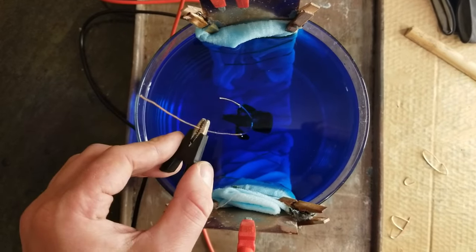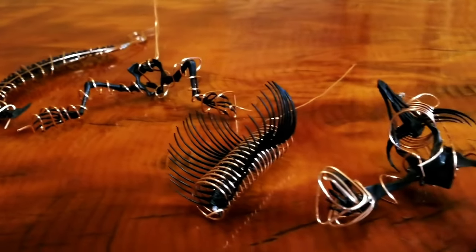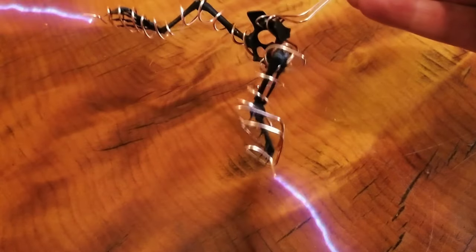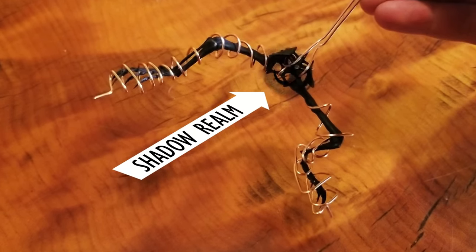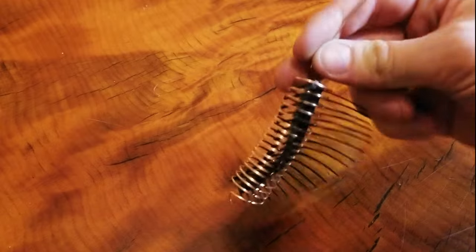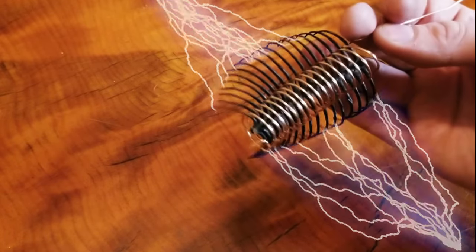The other solution is to change up the orientation of the print, by regularly repositioning it by hand or by using a constantly rotating mechanical jig. With these principles in mind, I prepared my 3D prints for plating strategically. For example, these legs are each loosely wrapped in copper wire, with a lightning rod sticking out past the pointy toes on each side. I also knew the inside of the pelvis was going to have anode shadow problems, so I intentionally ran the wire close to the inner surface to bring more current there. I took a different approach with the vertebrae, wrapping only the vertebral bodies with wire and leaving the ribs exposed, counting on all those little lightning rods to attract plenty of copper on their own.